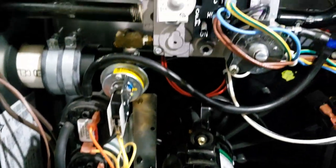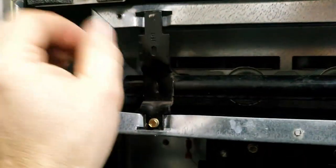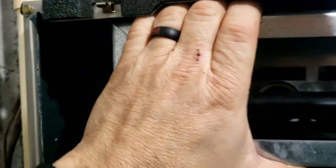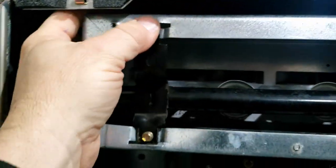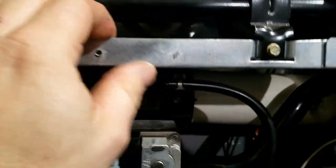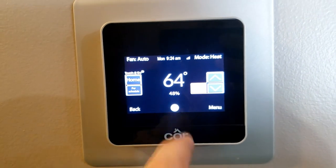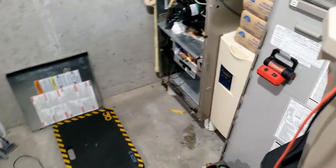I'm going to go up there and turn it back on and see what we get. We'll go ahead and see if it runs with the cover off. The current auxiliary heat is 25 degrees, lockout is 30 degrees, so it should start running. Look at what we got.